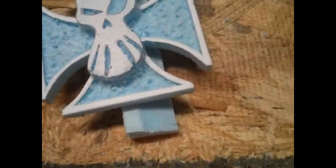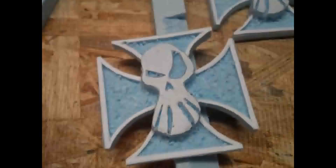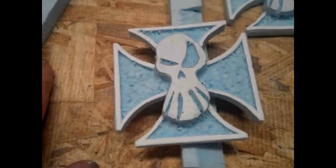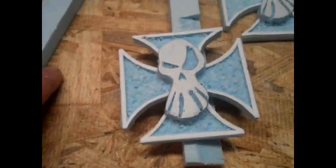That way I don't have to cut out as much metal when the casting is complete. I'm going to glue it on, one on each side, then put a pouring cup on top. I'm also going to put some drywall mud around it to hold the details, and then we'll be ready to cast it.